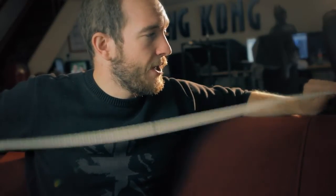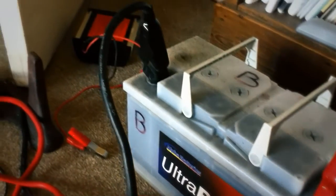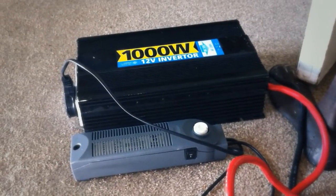The advantage is that there are no LEDs on the back, so all the light goes in one direction — no need to faff around with reflectors. After a few days of development, we managed to strip out all the unnecessary components in this configuration and get these things running off quite a high-voltage direct current. So rather than alternating current from mains electricity, it's a direct current — the sort you'd get from a battery. This means we've managed to go directly from battery to LED without any steps in between, which is really beneficial because it makes it much more efficient and means there's much less to go wrong.